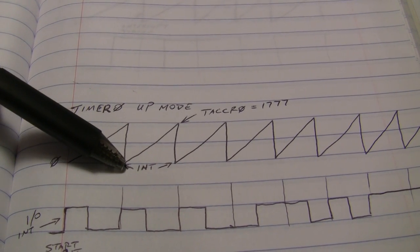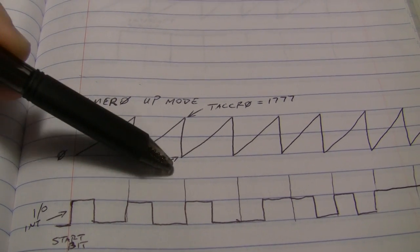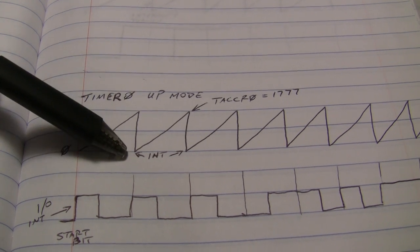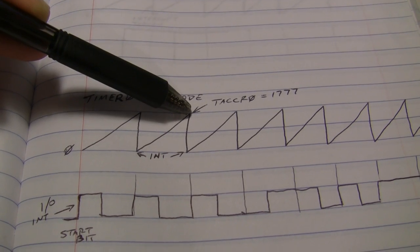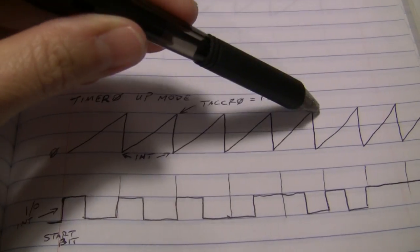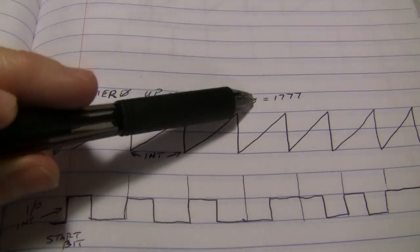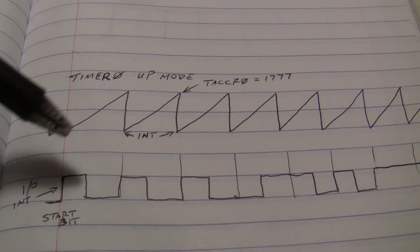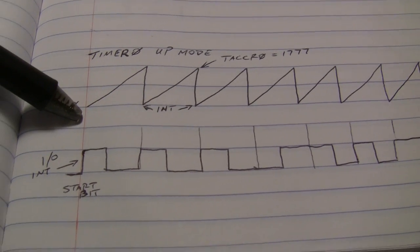It's going to drop back down, reset to 0. Each time it does that, it's going to set an interrupt flag. So it's going to count up, hit the threshold, set an interrupt flag, reset to 0, count back up, reset to 0, another interrupt flag, and so on, until we tell it to stop. So that 1777 is the zero based time we need for 1778 microseconds,